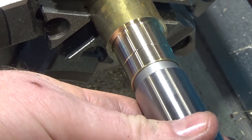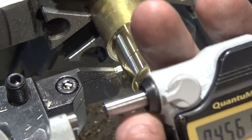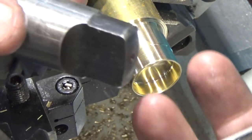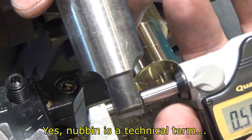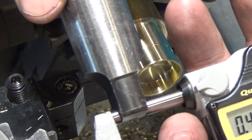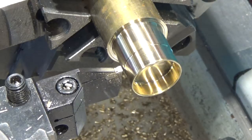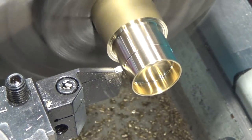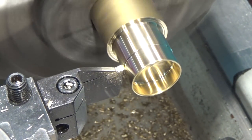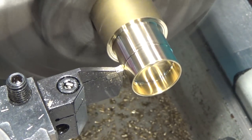With a really light tap that's going to go in. The little nub sticking off the back just needs to be smaller diameter than this tang here, which is 0.433, so we'll shoot for 0.4 — that'll give it something to push in a little sooner. Just making sure my zero is good, lightly touching — right on the money, perfect.